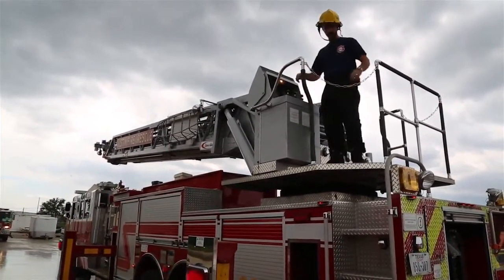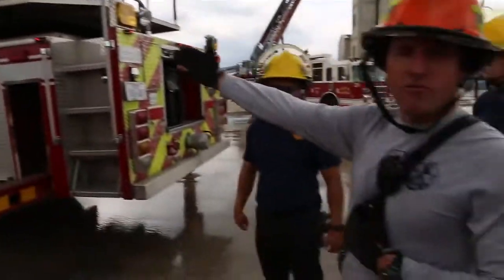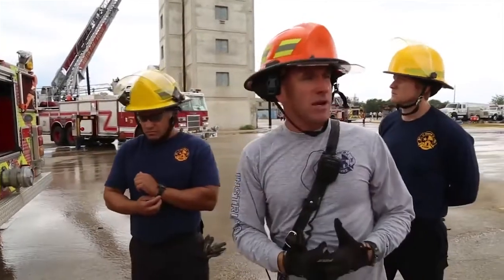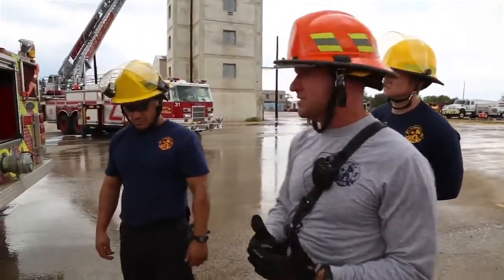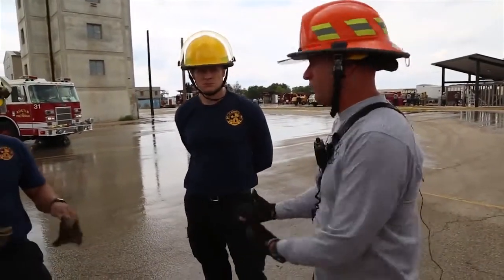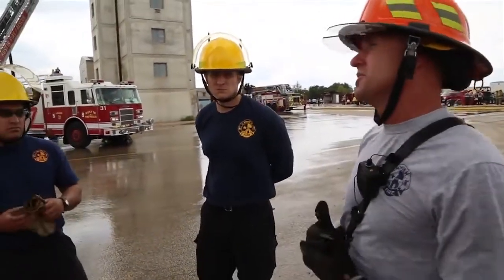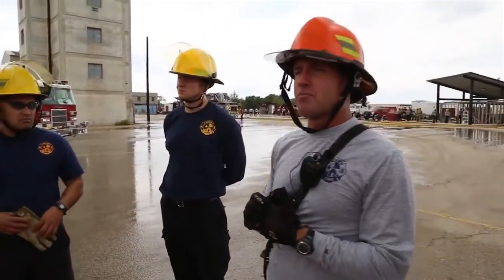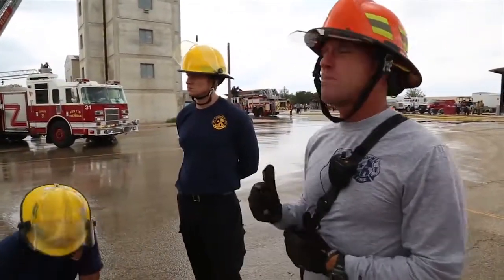This EPU will operate 30 minutes of runtime, 30 minutes of cool down time. I will need to voice that when I'm operating my EPU for skills testing. For you, it may be different. It may be 7 minutes for 30 or 7 minutes for 15. You need to research in your owner's manual what that will be. Now, we're going to say, for all intents and purposes, this is a continual operation.